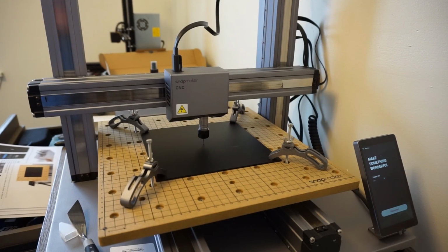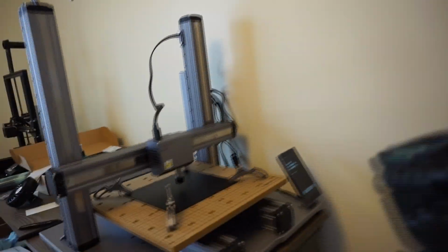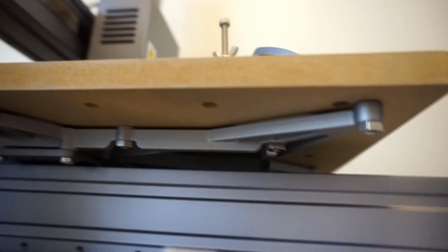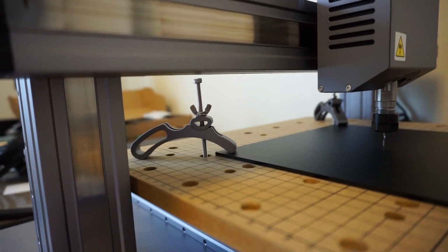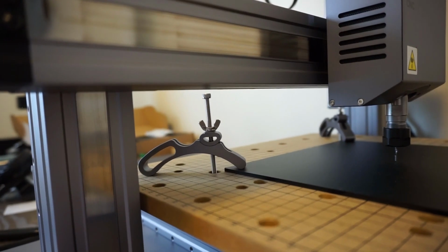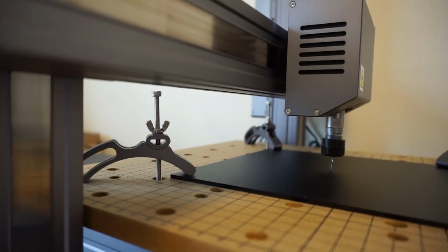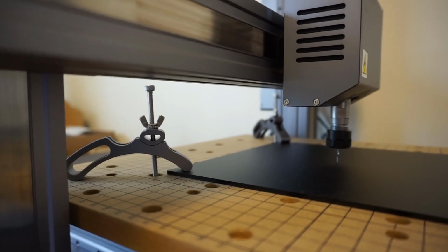One thing I am going to say real quick though, I'm going to have to move this, so don't mind the camera moving, but I want to show you this. As much as we want to try to not have the bolts come through the bottom and scratch the surface over there, my next concern, really, I was watching this the whole time, is the clearance here. So we're coming down a few millimeters. That looked like it was good where it was at. There was maybe 3 millimeters of space. We do have this coming down 3 millimeters. I am going to drop that threading on that support right there, on these back two, because they look kind of close, at least another 5 to 6 full turns, to make sure that we have clearance before we start the program.